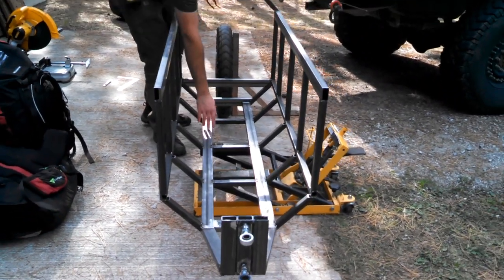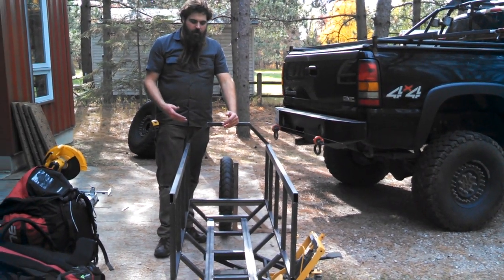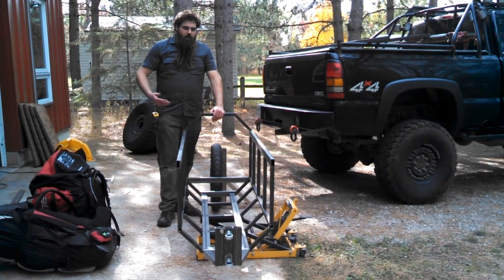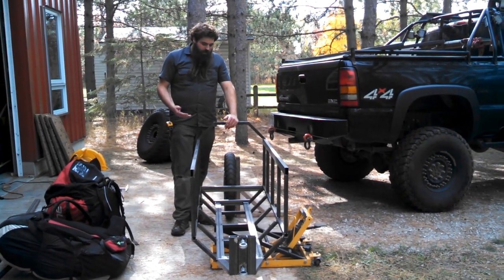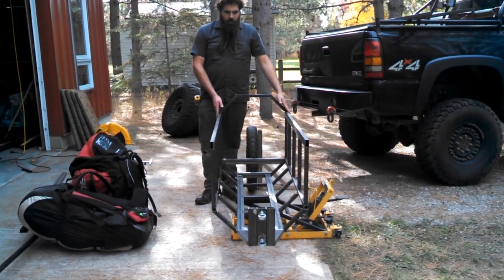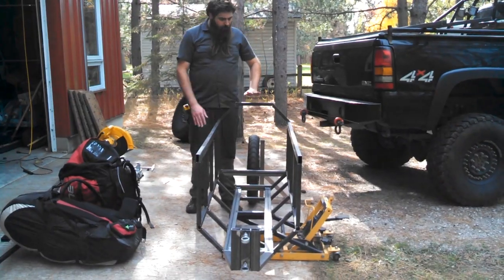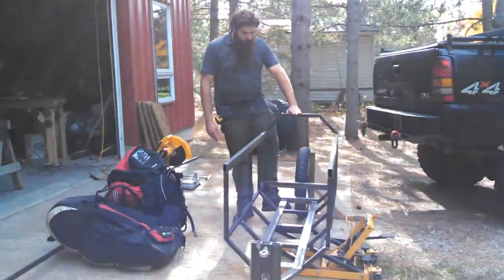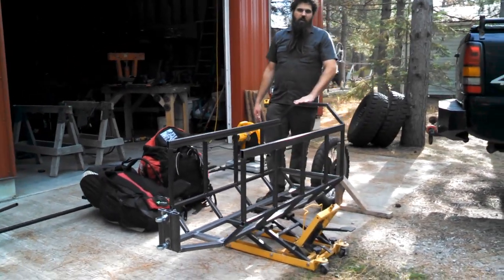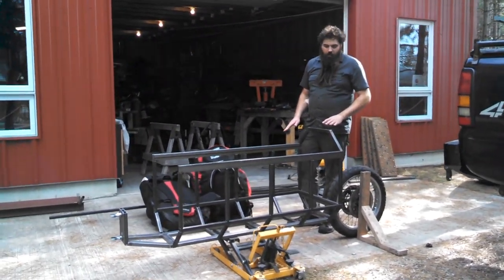This part will be the bottom, and on here will be aluminum sheeting, double-plated for strength. The sheeting is .040 sheeting, and it's painted — it's what they use on fish houses and things like that. The trailer itself is 2 feet wide outside to outside, so the inside is 22 inches, which should leave us enough room. Total height from here to the bottom of the trailer, which sits about 8 inches off the ground, is 30 inches, so this height is about 38 inches — generally a little taller than counter height in your house.